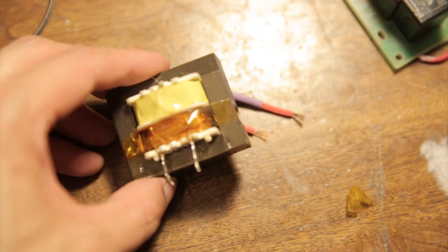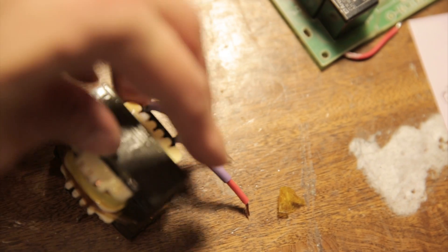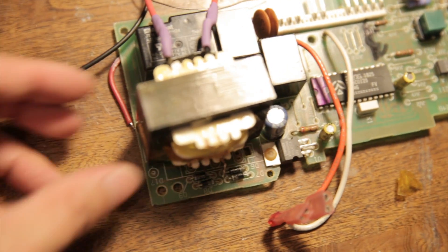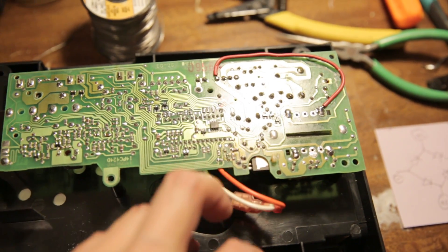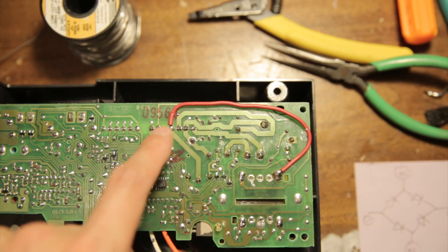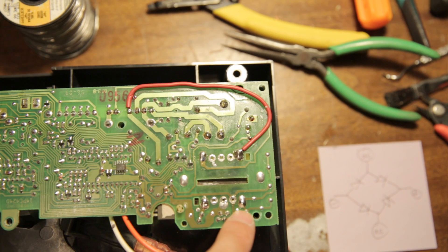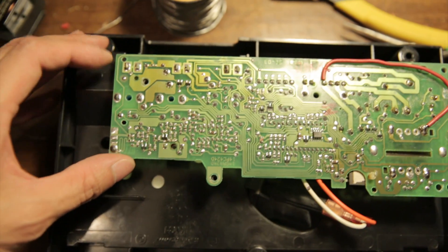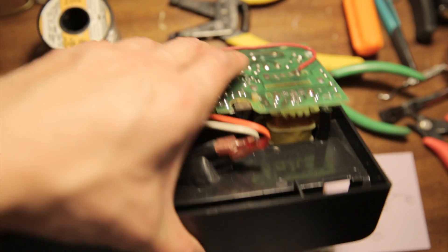I've finished modifying it and put the thing back — now it outputs 22 volts AC. I've extended the wires because it needs to stand up and reach the bottom of the PCB. That's the primary on this side, so I'm going to shove it right there and hope for the best. I've worked on this board before and accidentally shorted something, so that's why you see this extra wire — the circuit trace actually blew up. The output is here and here at 22 volts. The transformer is a little too tall — five millimeters — but I can mount it loosely and there shouldn't be a clearance issue when I put it back in the box.